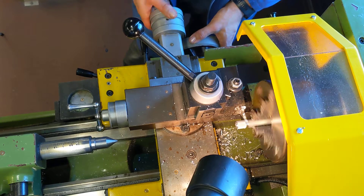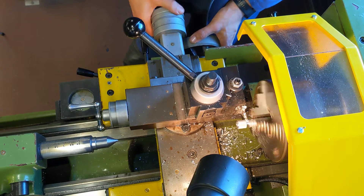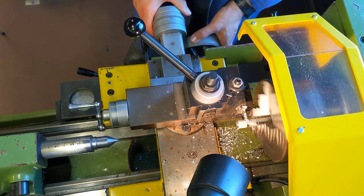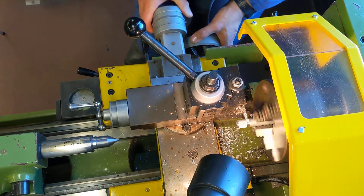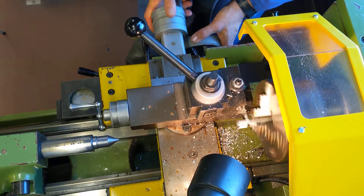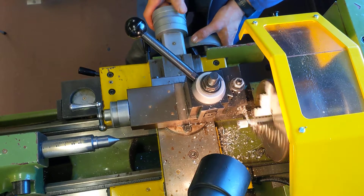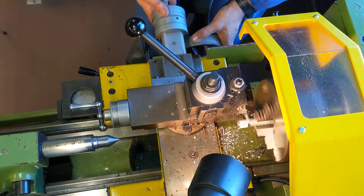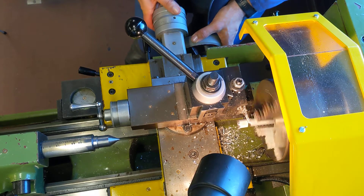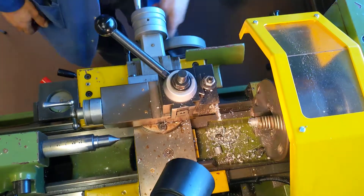This definitely needs a little bit of WD-40 on the cut — you'll find there's no squeaking noise and the surface finish is much smoother. The best lubrication for aluminium is actually paraffin — just a really, really light oil. Other cutting lubricants include soluble oil, which is an emulsification. An emulsion is like mayonnaise — basically water mixed with oil, shaken up — and it's very useful indeed for cutting jobs. And there it goes, it's just dropped off.